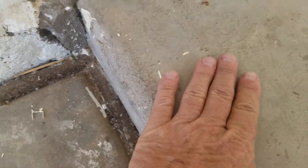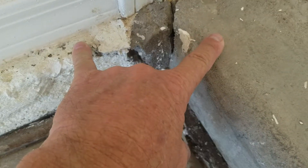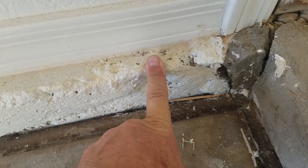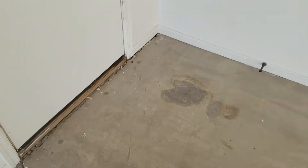This is the interior floor and this is the perimeter footing — this is a construction joint. There are two elevations here. The interior floor is slightly higher than the original perimeter foundation wall. The vertical breaks in the other video were indicating settlement, and this is an indication on the interior side of settlement — verifying that fact.